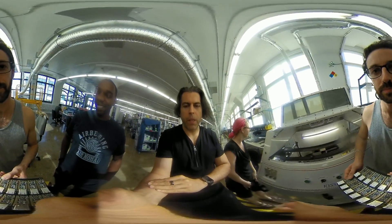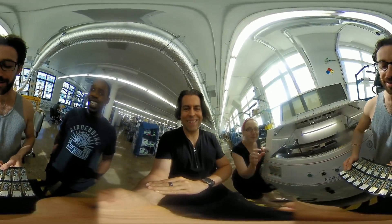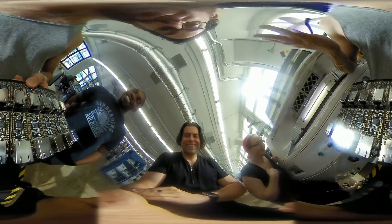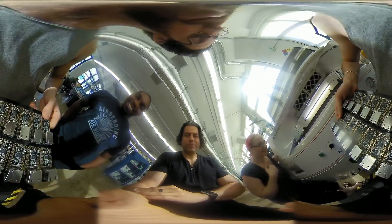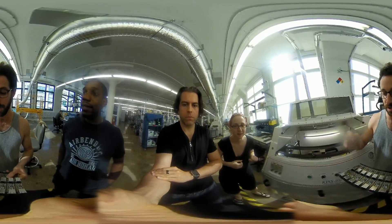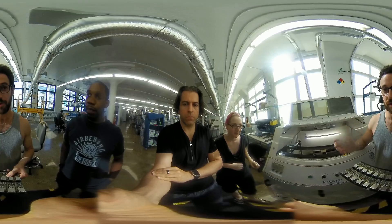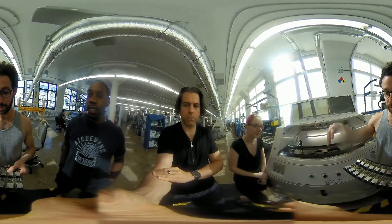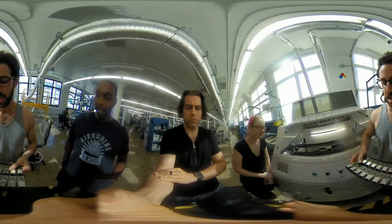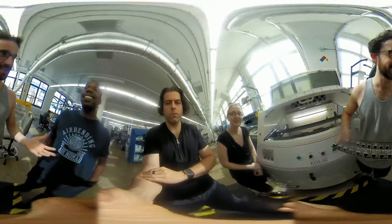So molten solder is kind of like Terminator 2 — like T-1000 a little bit. Very tiny T-1000, equally as erratic. The whole thing over here is all about trying to control the purity of our nitrogen, which helps us protect the solder joints, makes them less porous, and gives us less workflow for Vance later on.